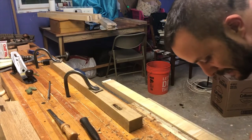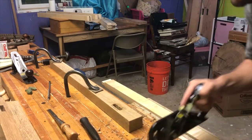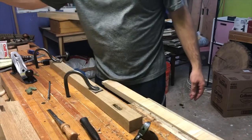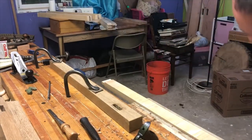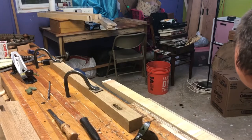I mean, on a table saw, yeah, you make your little mortising jig and your tenoning jig, and you run it through there and you can churn out 100 identical tenons. With hand tools, you gotta sit here and you gotta fit, you gotta fuss, and you gotta do all sorts of other things. And you gotta know how to use a chisel.